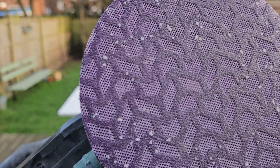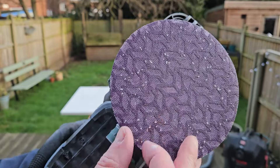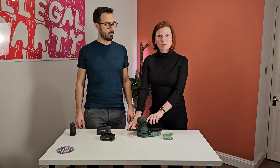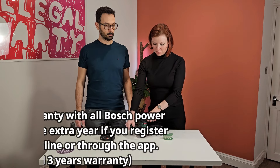Here's a fantastic tip: if there is a need to stop at any point right in the middle of sanding, once you've lifted it off, make sure you do not make contact again with the machine active. Stop the machine, place it on the surface, and turn it on again. Because there aren't holes to pass the debris and extract it away from your work surface, you need to be careful that there's not a build-up in the net of debris that could damage the surface you're working on. Notice how clean the disk is — no unnecessary debris hanging around. As you can see, it also had low vibration, which is very comfortable when you're working for long periods of time.